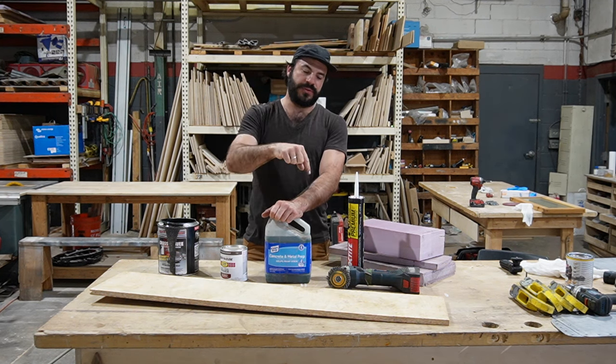So what I'm gonna go ahead and do is cut, let's say, 8 inches off of that first plywood sheet, which means that when I get to the front here, it'll be long by just a couple of inches. Let's see, by about 3 inches. And I'll be able to have that to work with to cut off up here. So that looks pretty good. Maybe we'll cut 7 inches off the back just to be extra safe.